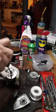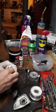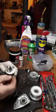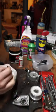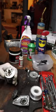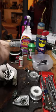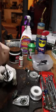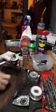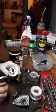The number two failure, quite interestingly enough, is there's too much grease, and that the grease is coagulated, and it actually forms a barrier that inhibits the reel from turning. So regardless of what it is, either way you can work it. This one was clean. If it was too much grease, I would recommend using a WD-40 or something similar to break up some of that coagulation, and then I would be at the step that we were just at there with releasing it.